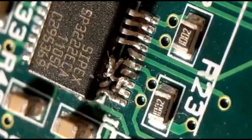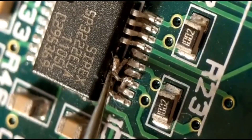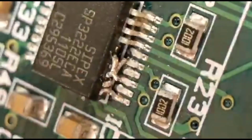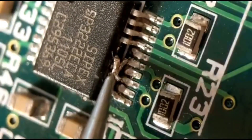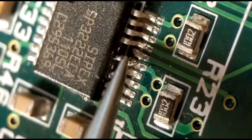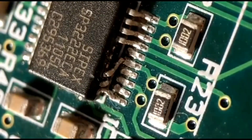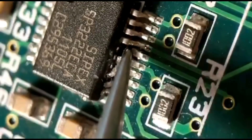The first operation on this IC is to basically clean up all the remains of what's left — get all the old damaged parts off. The main thing is, as long as you can see a bit of copper coming out of the body on each position, you've got half a chance. Just try and gently clean everything up. If you can get a little bit of copper coming out of the body, that's all you need.